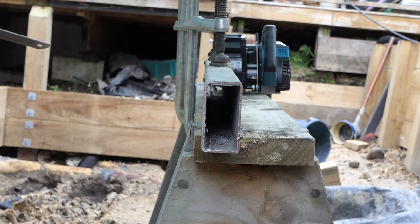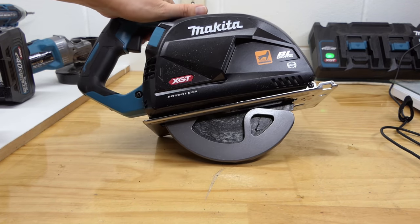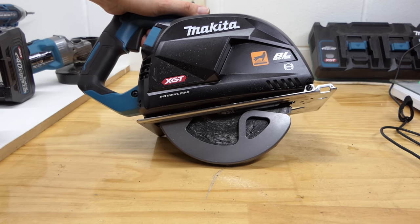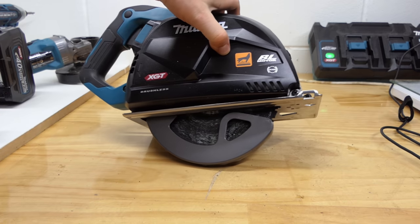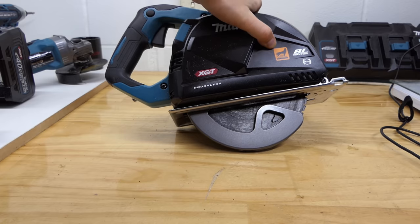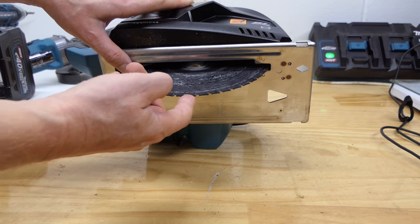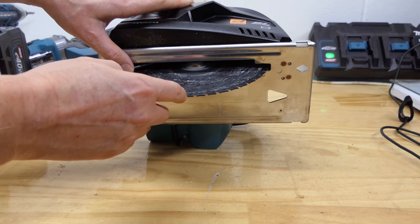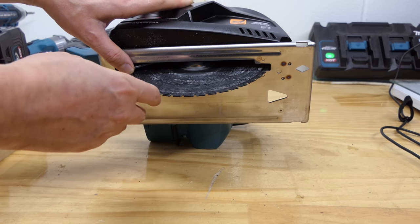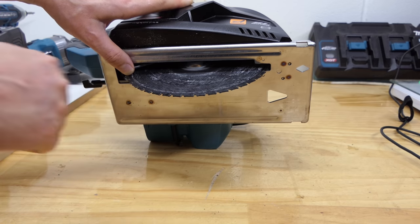Makita rated it as 67mm — that's probably 67mm plus a little bit for clearance of the tips. I do find you can usually cut a few millimetres deeper than what they say. The blade it comes with covers 1.2 to 6mm material and has 45 teeth. There's also a 38 tooth blade for thick material and a 60 tooth blade for thin material such as corrugated iron, thin sheet metal, and housing framing. So plenty of options, and this blade cuts no problem through stainless or mild steel. I've also cut plastic with it — wouldn't recommend that, because the filings jammed up in the chip catcher due to plastic blocking it. Don't cut plastic with it — that's my tip of the day.